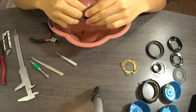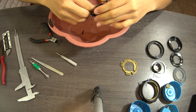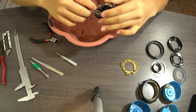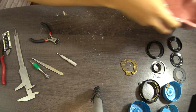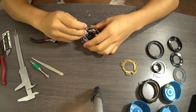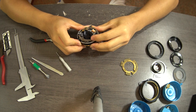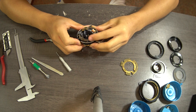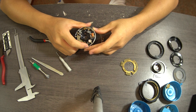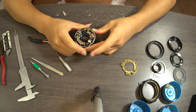So let's see, spring, switch it out, then push this thing in front of here. Okay, now the shutter should be independent right now. Let's see. So this can move, and there you go, nice aperture. It needs a stronger spring. I'm going to have to pull the spring a bit more, but it now works independently, so nice.